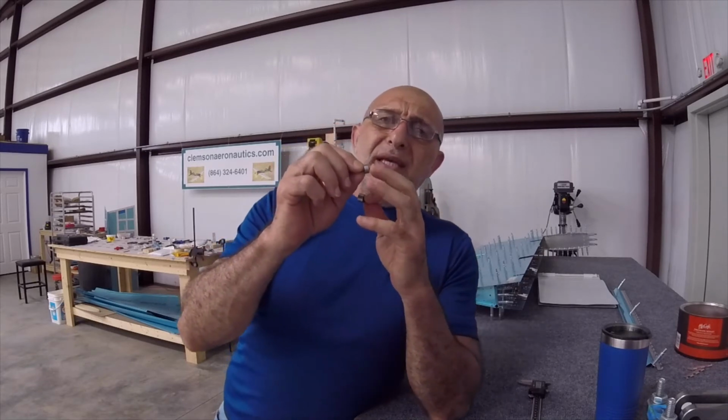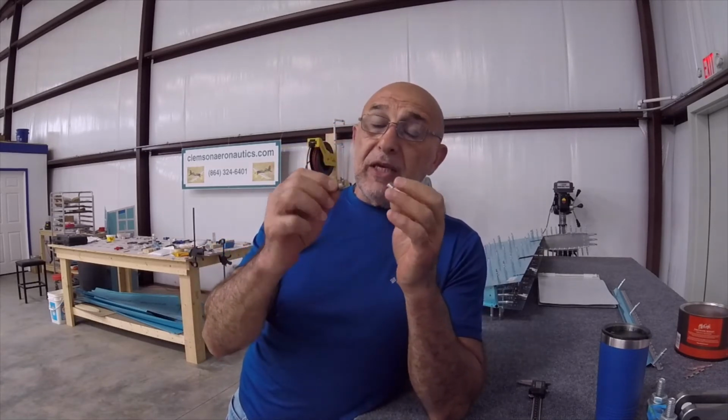Now, in planning, when you are going to dimple a surface like the rudder or the horizontal stabilizer or a vertical stabilizer or whatever, you're going to prime it. So when do you prime? Before you dimple it or after you dimple it? Priming before you dimple, it will pack primer in your die, and you have to stop and clean it up to make sure that it's cleaned up.